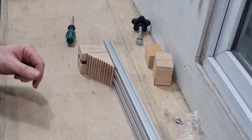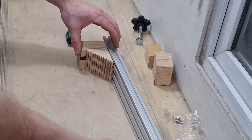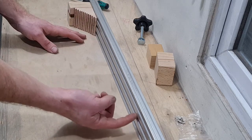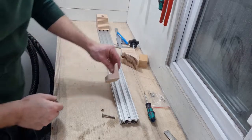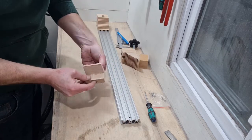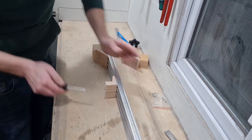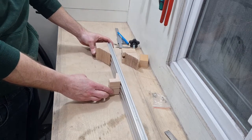That's the basic part of it done. You could actually use it like this already just for cutting tapers, but I'm going to make another little taper for the other end. So if I fall between a step at the angle I need, I can just adjust the taper of this end by bringing it back or forth under the workpiece to fine-tune that angle a bit.